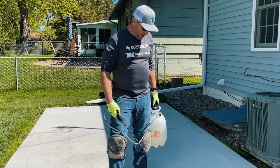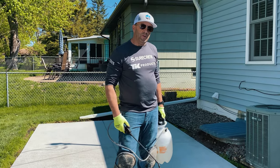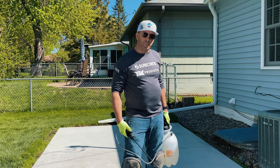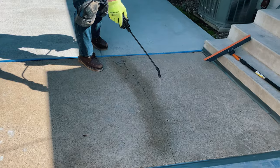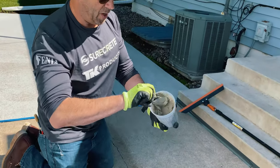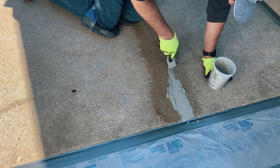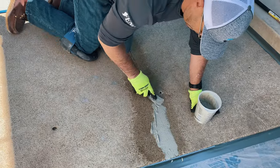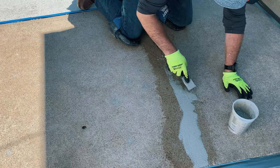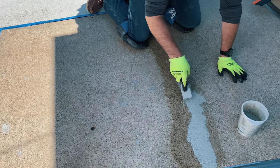There's an older piece of concrete here that we're going to put the SureBroom over so everything matches. It does have an old crack — it's probably been here for a long time and isn't moving around. We have crack repair materials covered in other videos, but for this application we're just going to take some SureBroom mixed up a little bit thicker, lightly dampen the surface, and work that into the crack. Scrape all the extra material off so it doesn't show up in our finish.